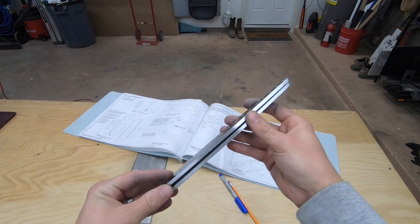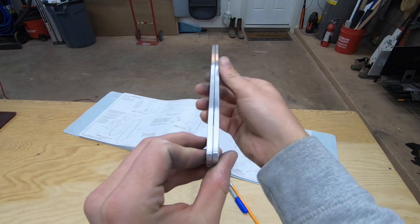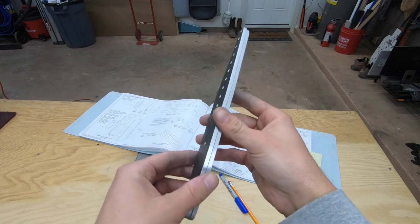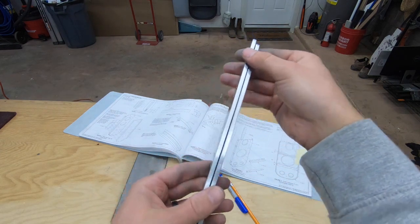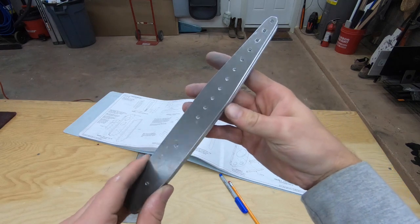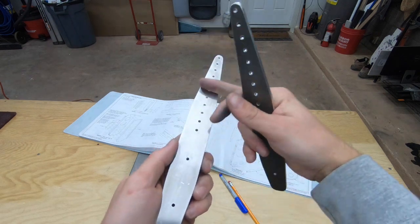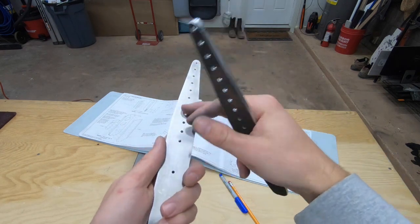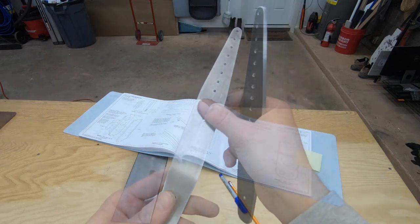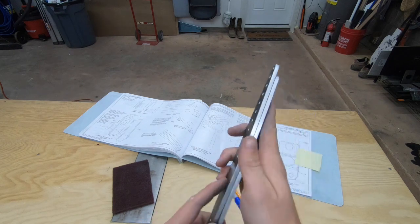Hopefully I got a good shot of hitting these with a hammer, but got them nice and straight — definitely within that 1/16th of an inch tolerance that Vans recommends. Then took these edges and made them nice and pretty: used a file, followed it up with the Scotchbrite wheel and Scotchbrite itself. If I were to do this again, I'd probably leave the blue protective material on one side where we were hitting it with a hammer — it left a few scuff marks. I'll prime it whenever we go to assemble.